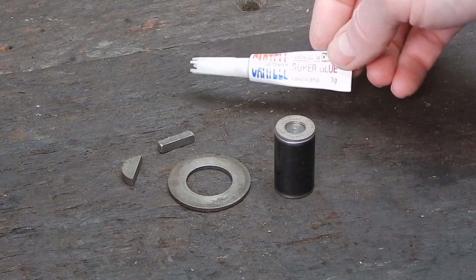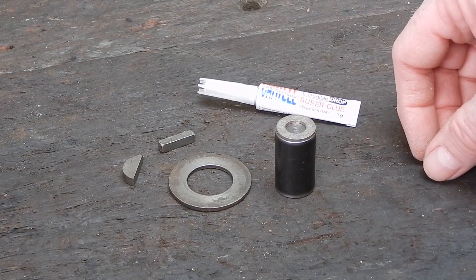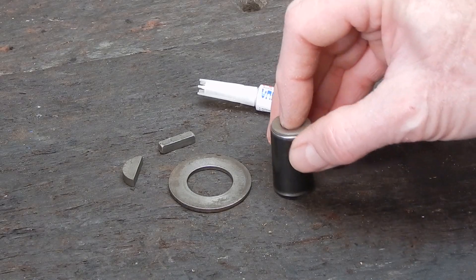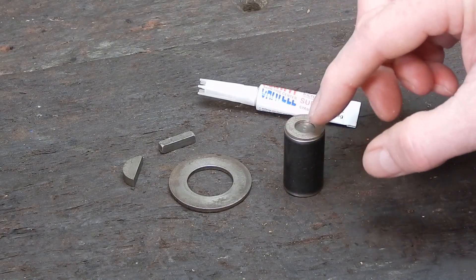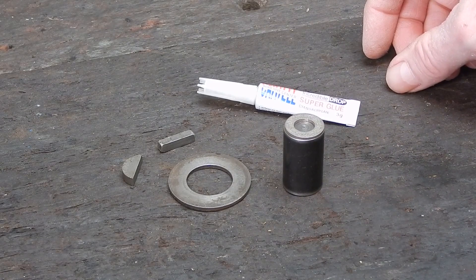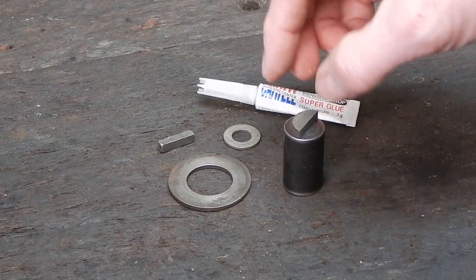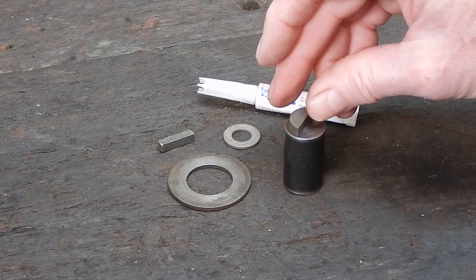Being a very thin glue it won't really have a significant impact on the thickness of the job. Once the super glue is hardened, we're going to mount the round stock in the jaws of the chuck and then face off the washer to the correct thickness. Now if it was a woodruff key, you can actually make a woodruff key using this method by doing round stock, then slicing it, and then grinding your woodruff key back.